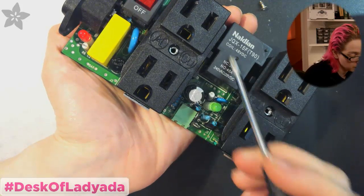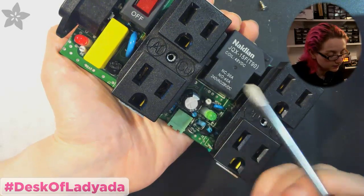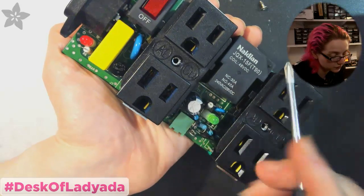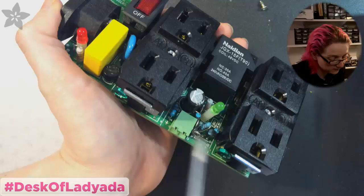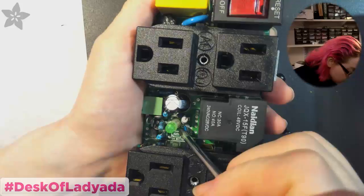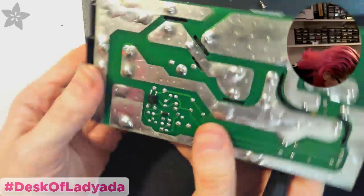And that's because it's probably cheaper to get a coil that's 48 volts than to get, it's going to be hard to get a 40 amp relay that runs at 3 volts. It's just unlikely. To move that much current, maybe your armature is very large, you want a higher voltage. So yeah, the only thing I can't quite tell is, this says ISO, which makes me think it's isolation, but it's on the bottom.